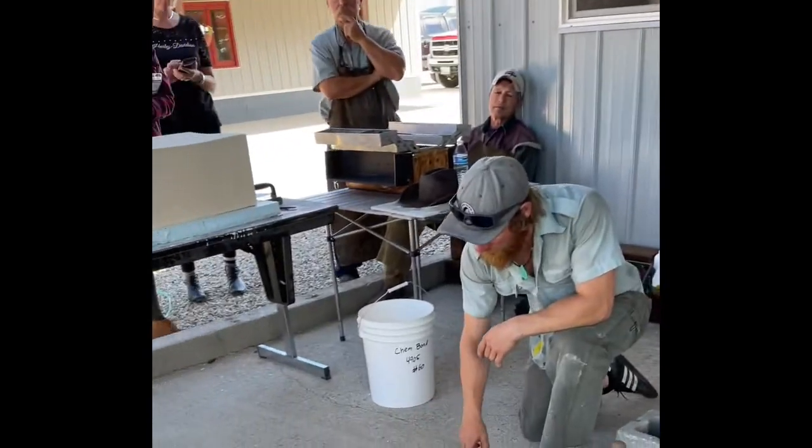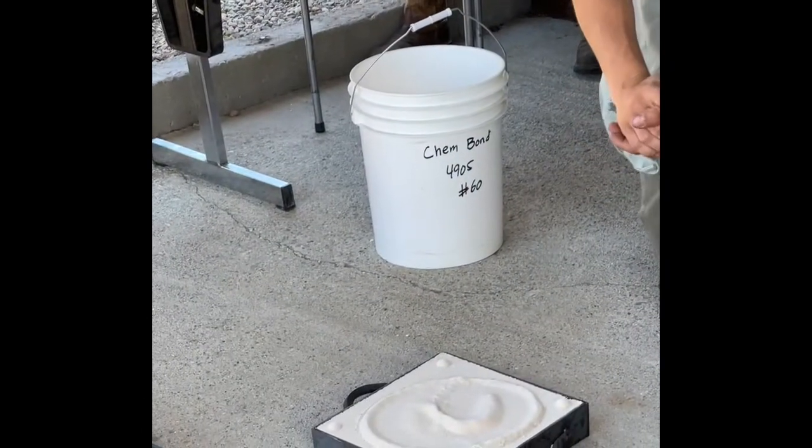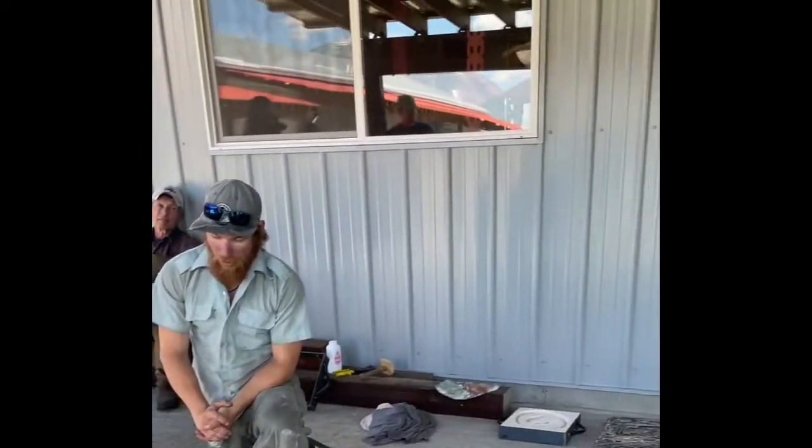You also don't want to skip the keys — these put registration marks in it. That's going to cause funky casting; it's going to be thicker on one side. The mold might be touching on the outside and then you'll get a hole.